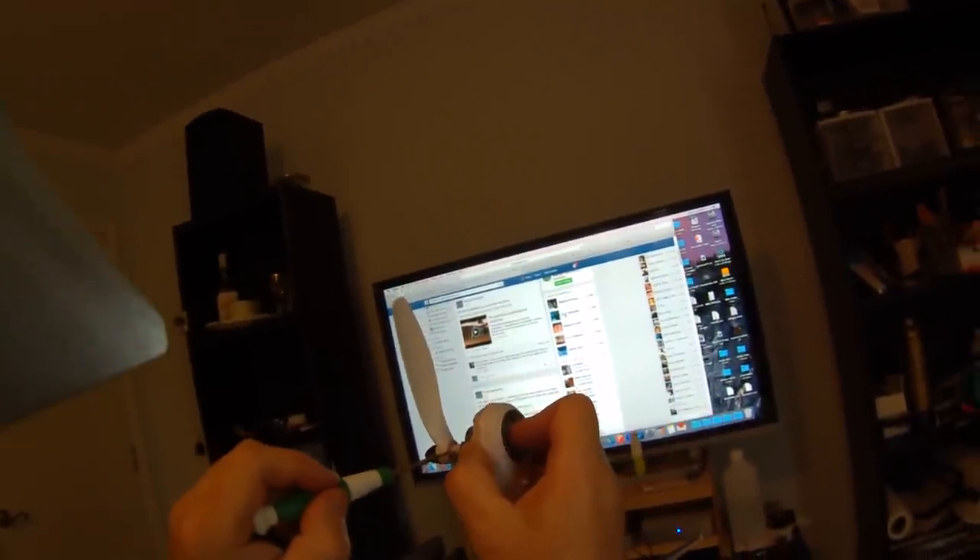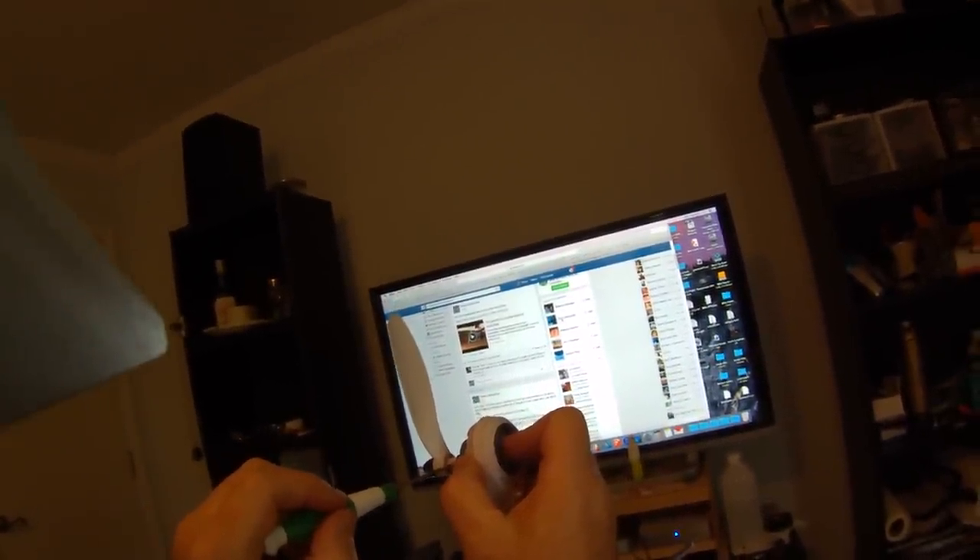Line everything up. I can see the light through the hole. I get the light where I want it, take a pin and stick it through there, wobble it around — that centers it. So when I put the screw back in, it should feed right through.